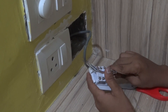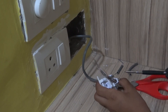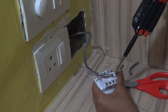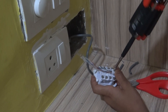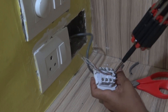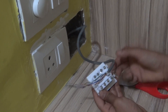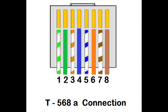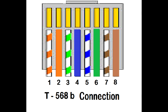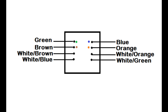After doing that, at a comfortable point, tighten the screw so that the wire sticks on to the casing. We have tightened the holder screw — now just check if it is not shaking. This is a T568A type connection which is not commonly used, and this is a T568B type connection which is very commonly used. You can try the T568B type connection first.